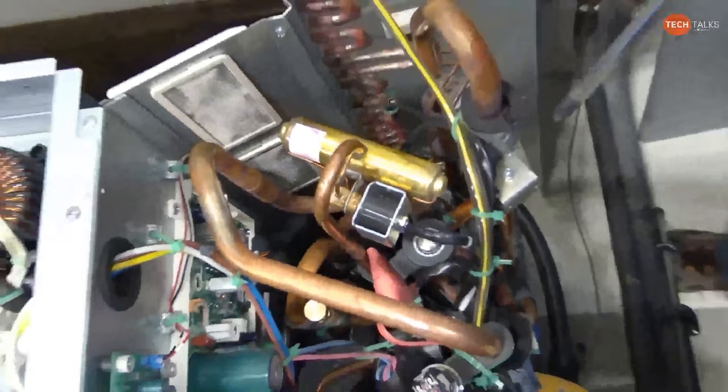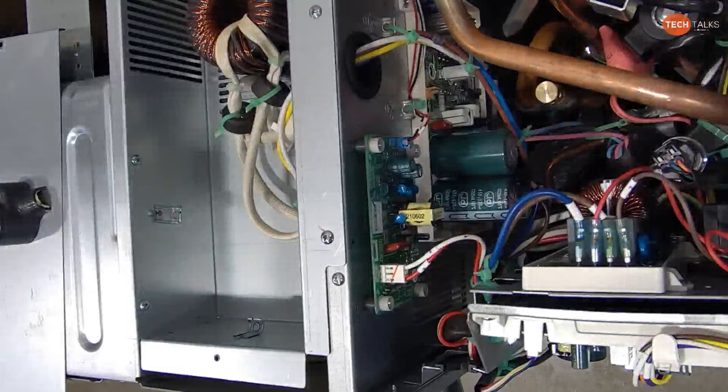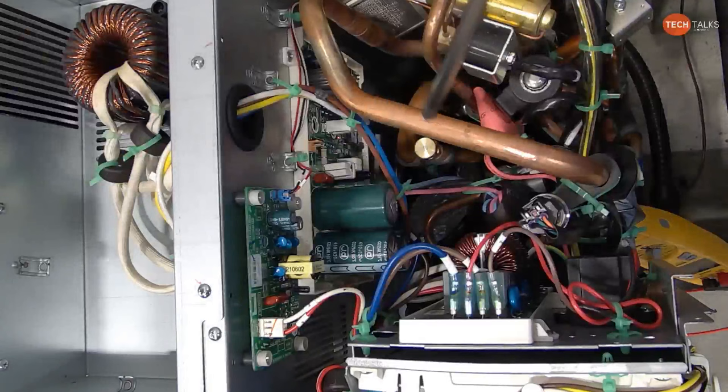Now, he mentioned the P6 code. It's hard for me to show you on camera, but the boards are actually marked specifically where you should read the 3.3 volts. So they don't have to remember it. All they know is they need to check for it, and they can measure right on the board. It says 3.3 volts on the front of that board.